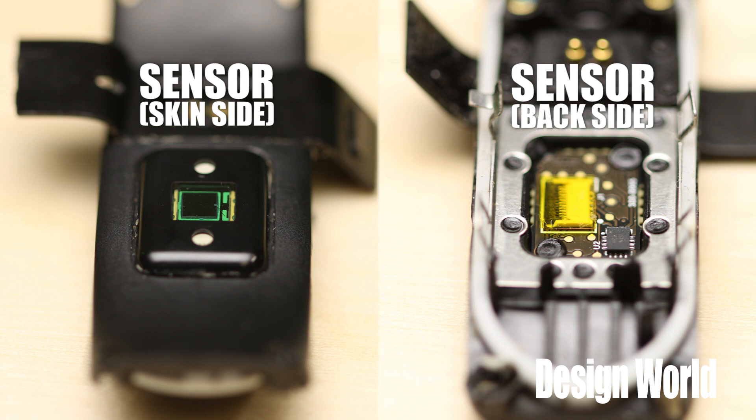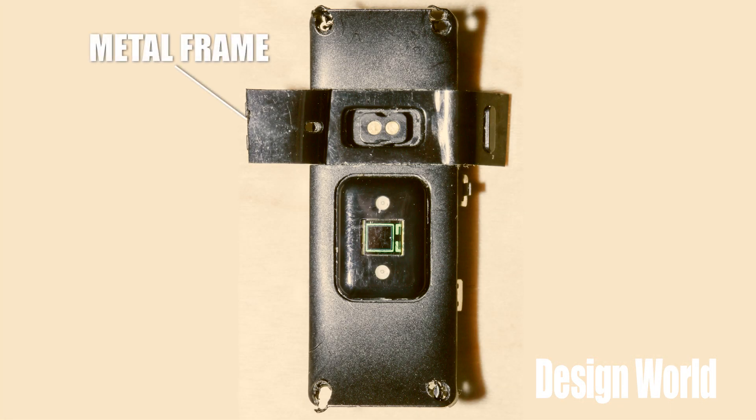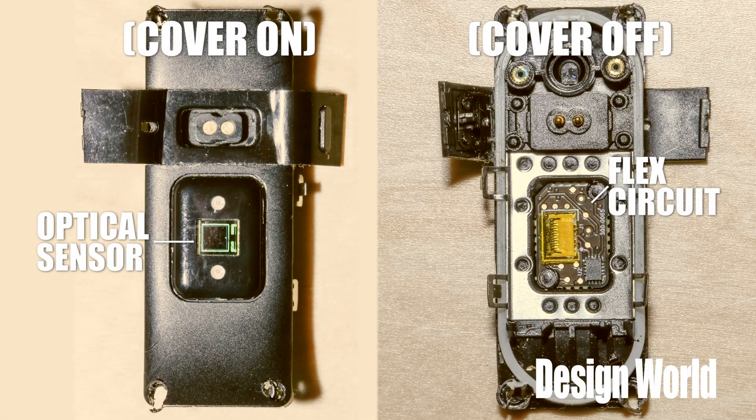And no matter how good the connector to the main circuit board is, it's a potential source of noise that could be significant for the super-low-level changes in reflectance you'd be dealing with when detecting heartbeats. What else can we point out about the part of the watch that holds the sensor substrate? The other interesting bits are the connection for the recharging cable, which is reinforced with its own metal frame. The heart rate sensor connects to the rest of the circuitry through a flex circuit. What's interesting is that the connector to the flex circuit lies directly overtop the optical sensor. We might surmise that the Fitbit designers really wanted to minimize the chance of those heart rate signals getting garbled, and that might be one of the reasons for situating the connector right where it is — it might provide some shielding against other signals floating around on the main circuit board.